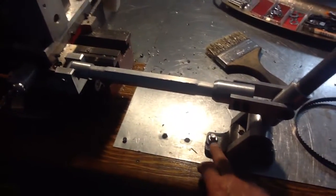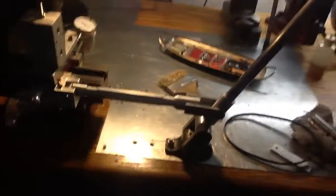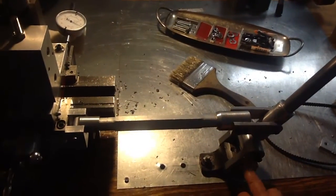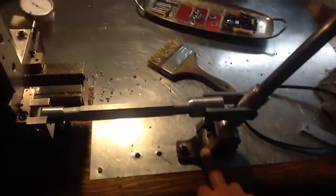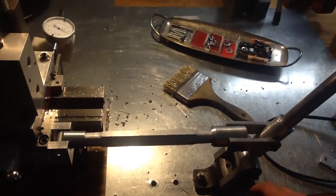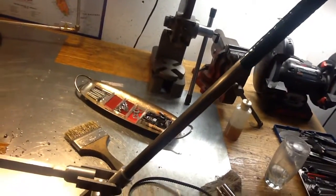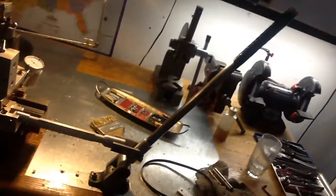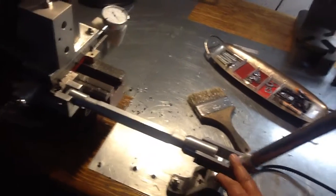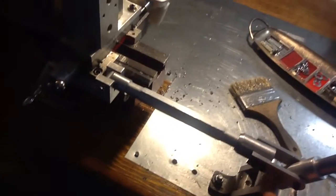I found a nice casting at the junkyard — just junkyard scrap for a pillow block. There's no bearing, it's just a piece of cast iron. And then I'm not sure what you would call this — the yoke for the lever, just machined up out of bits of aluminum connected up here. And then a nice stainless steel solid bar that I found somewhere — I've had that thing for years. This is machined up, there are some notches machined there for this to connect on, and there's a threaded piece in there to get that on, and then another threaded piece here to connect that.